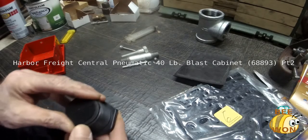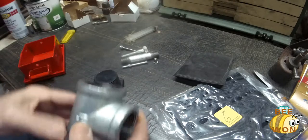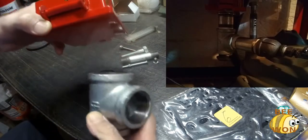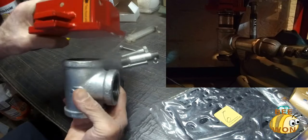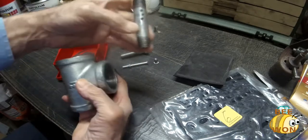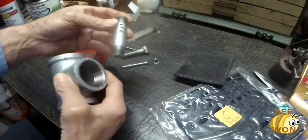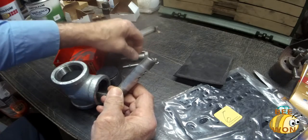Before I get carried away doing other things, I've got a couple things laying here I want to show you. This is going to be my metering valve that comes out of the bottom of the plate. There will be a four-inch, inch-and-a-quarter nipple coming out of the plate here, going into this tee. And then another four-inch, inch-and-a-quarter nipple going over, and this is going to be in that four-inch piece of nipple. I bought six inches but it's just a little too long — trying to cut down a little bit on weight. This is a three-eighths nipple NPT, National Pipe Thread.